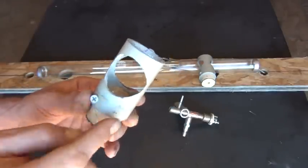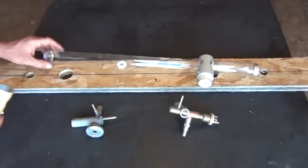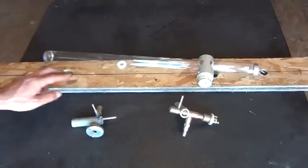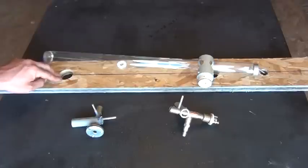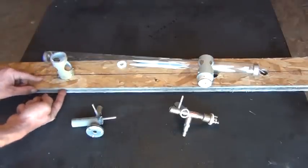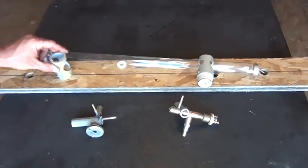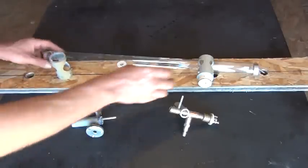But actually, I pre-drilled some holes all the way through it, set those two screws in there to hold the wooden plug. Down here in the base, I've drilled a hole saw hole, so each one of these plugs, you can see my straight line. So I drew a straight line, made sure each one of the centerings of my drills were right, so I could drill through the hole saw hole, and that allows that plug to drop in there. That gives me some mounting capability into this block. Once I'm done, I'll be able to set a set screw in through the side, either one of the sides there, and actually mount that in a steady position once I set the lasers up to do the alignment, which I'm really close to doing, but that requires gluing, so I wanted to show you how to do this before we got there.